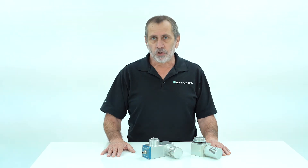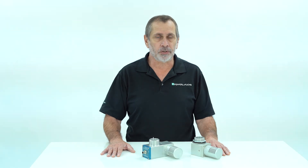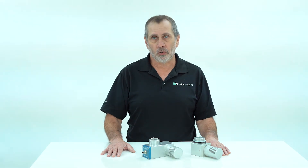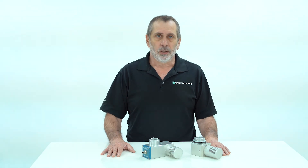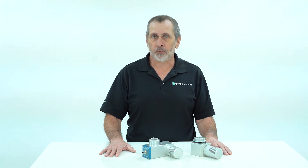After you're finished purging, all you have to do is pressurize it. During pressurization it's pretty much sealed; however, you still need a pressure relief device in case the regulator fails — which usually fails open — or somebody adjusts the pressure too high. You don't want that square enclosure turning round, so you need to release that pressure. We have different types of vents at Pepperl+Fuchs designed to operate for purge pressurization systems.